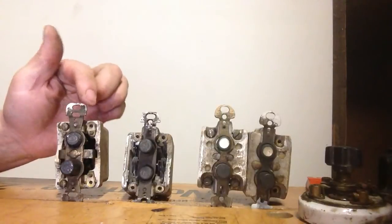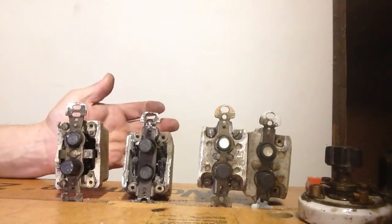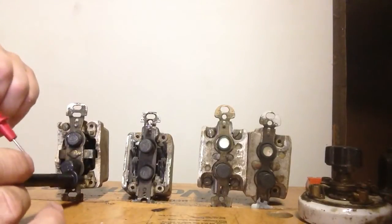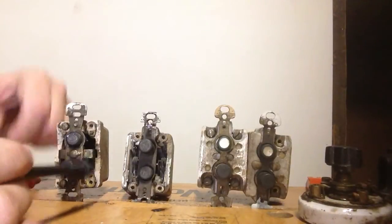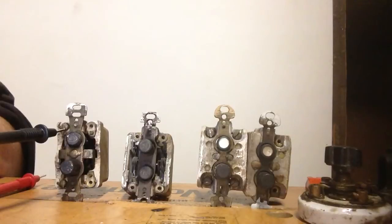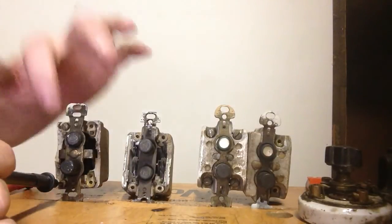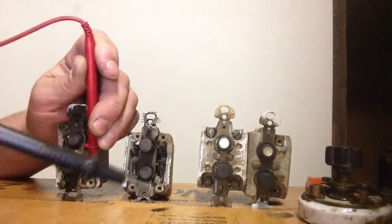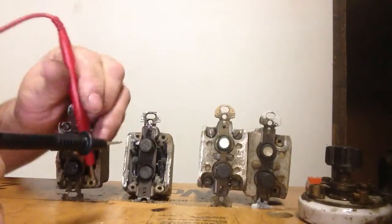You can't just guess — oh, there's only one wire hooked up here and one wire here and one wire not here. You can't, you don't know which ones to call them. By testing this you know that this one and this one are connected, and these two are your switch wires. Power originates in one of these two, starts here, goes up to here and over to this side. When you switch it the other way, power goes over to here. So if your wire's hooked here, power goes from here to here. When you switch it, power goes up here and across — that's the path, up and across.